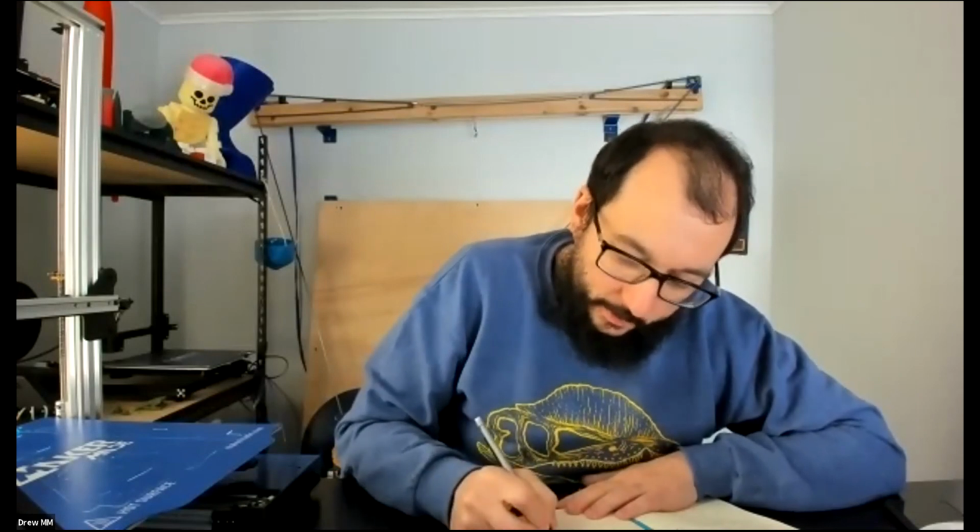So Mia, sorry it took me a bit to get to your question. I see that's in there on the firmware. I had that come up because I had the wrong board selected. Have you downloaded the SAM boards in the board manager?